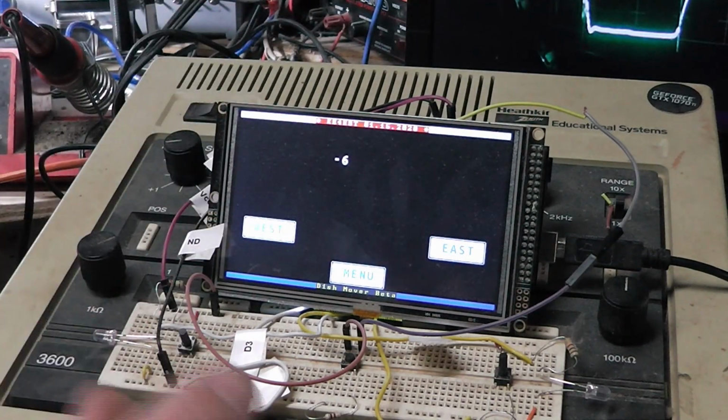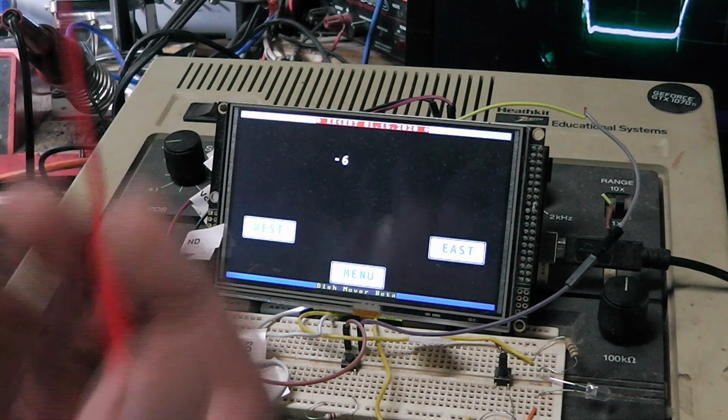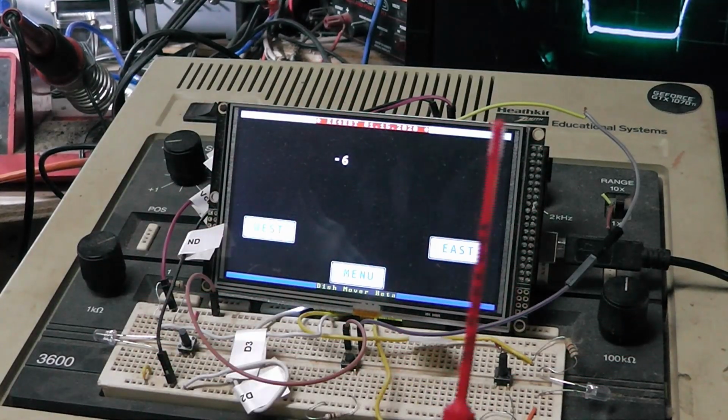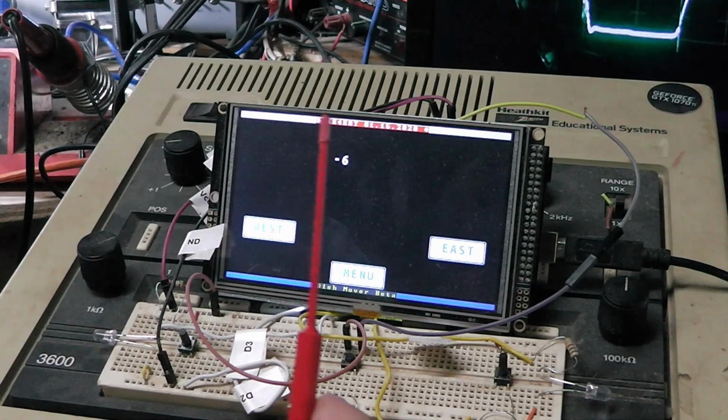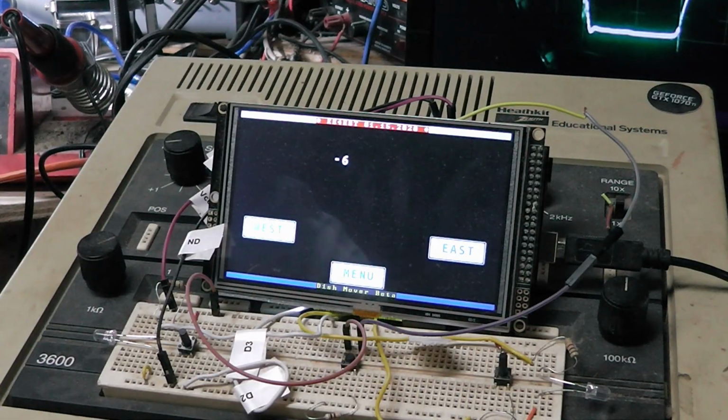So you'd want to have it about... What I found out worked out really good with my other one was 300 milliseconds. I know people like with the ASC1 come in and ask, hey, can we get that changed to half a second because we get noise, or I'm using this kind of motor, I'm using this dish mover, whatever, and it ain't working. So I think Brian finally had it set up to a half a second. But it really should be 100 to 200 milliseconds. But sometimes it will get a little, even though nothing's wrong. So I found the best sweet spot was about 300 milliseconds.